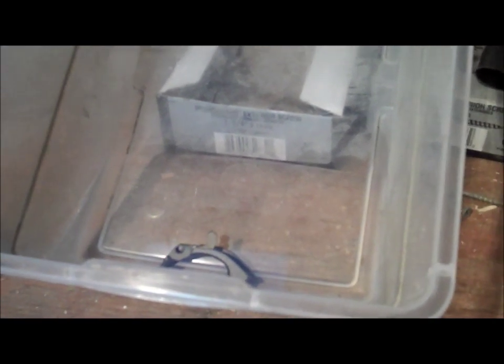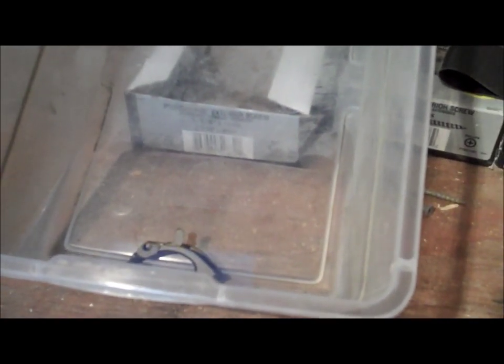So this has been sitting for about 9 minutes since I already Cerakoted it before, and I know that it's gotten most of the gunk off of it. I'm just going to give it another minute. Then what I'm going to do is put it into the oven and let it bake out all the oil that might still be in there. And then after that, I'll sandblast it and coat it. And you'll get to see that in a little bit here.